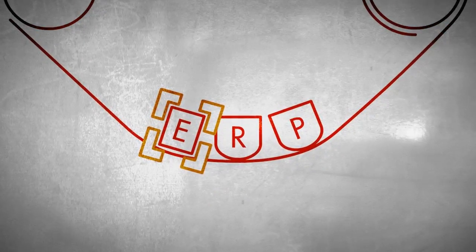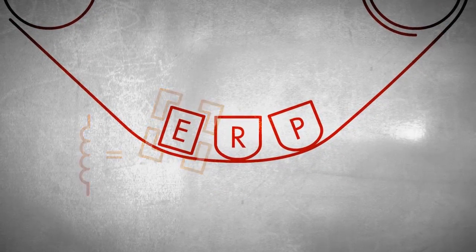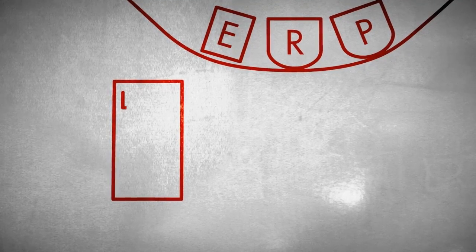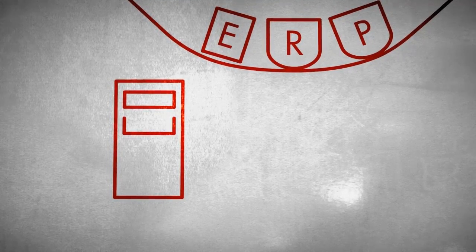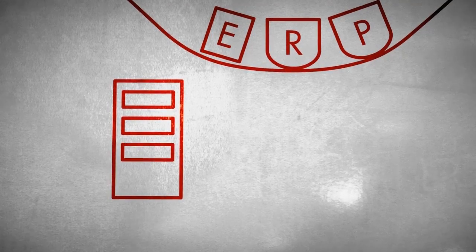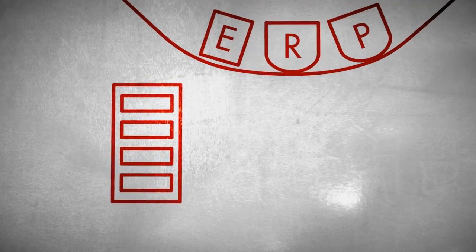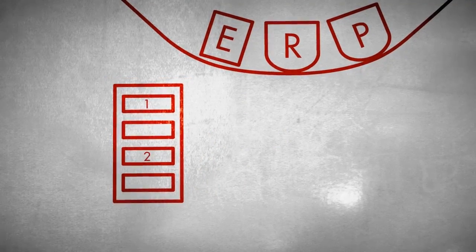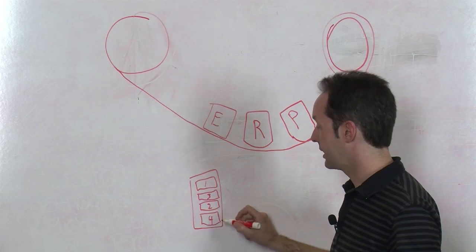The erase head is just an electromagnet. But under the erase head, if you look at a head on edge, you'll actually see, because this is a 4-track machine, the erase head isn't just one electromagnet, it's 4 electromagnets. And this is for tracks 1, 2, 3, and 4. And yeah, they're arranged like that.